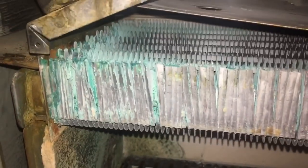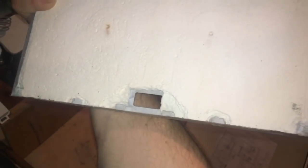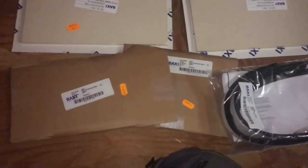If you open up a boiler heat exchanger and you see combustion pads that are cracked, the main thing you've got to ask yourself is, is this how the manufacturer intended it? Because if it's not, then you need to take action. And what will happen here is the heat will escape where it's not meant to, and things will get hot.